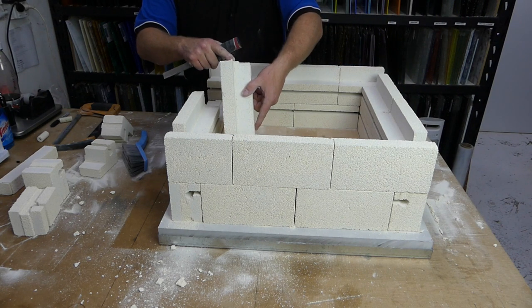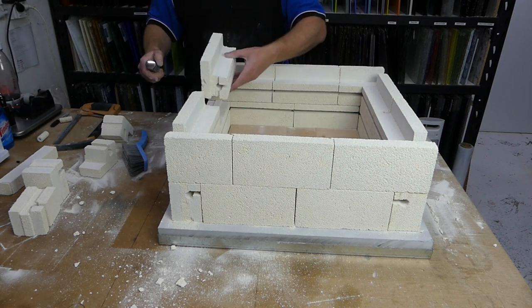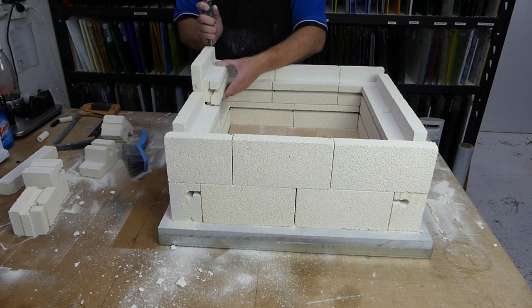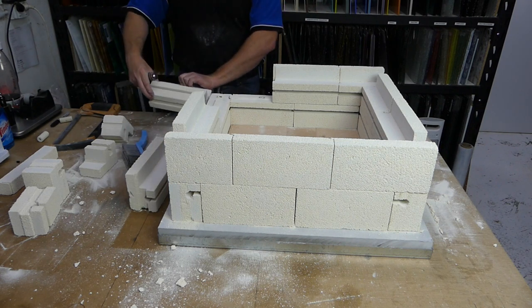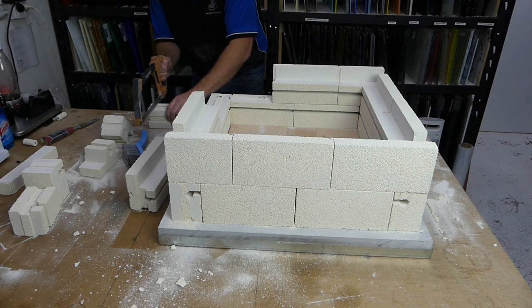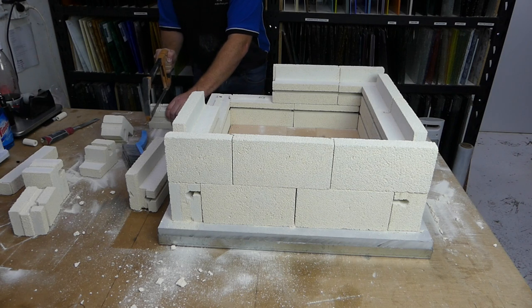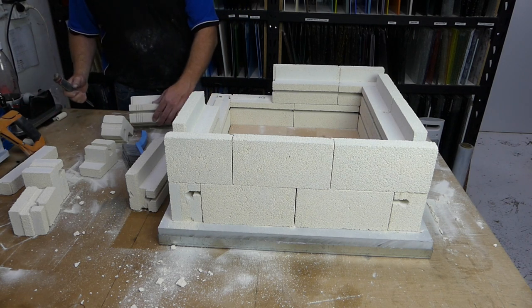So on this brick you've got the tongue on the end. We're just going to slide the chisel down the tongue till it hits the brick in front of it, and then that's where our mark goes, and that's where we need to remove the tongue. I'll remove a space for the tongue. So this brick comes off again. Last time this brick comes off. No, it's not. And again, because I'm getting tired, I'm just doing four cuts down the brick.